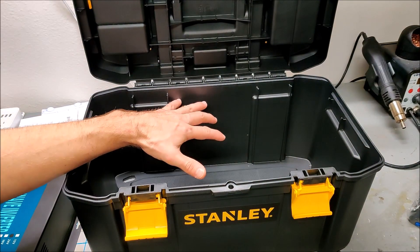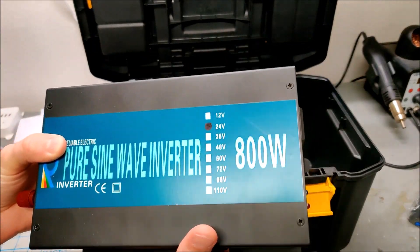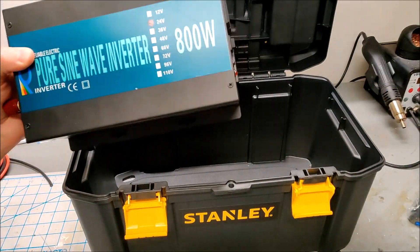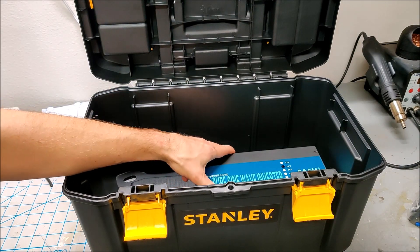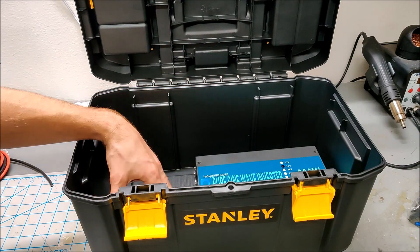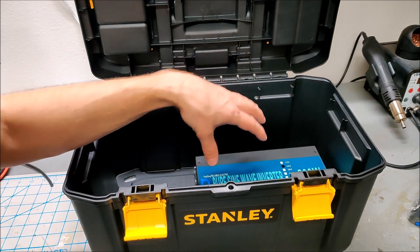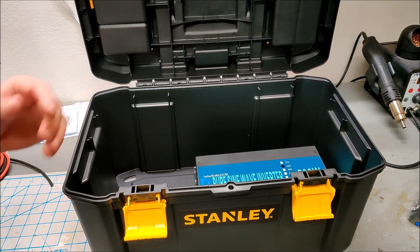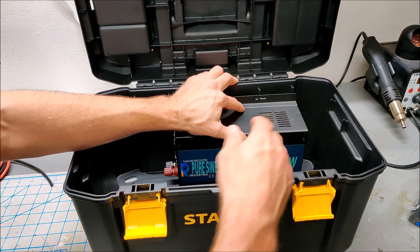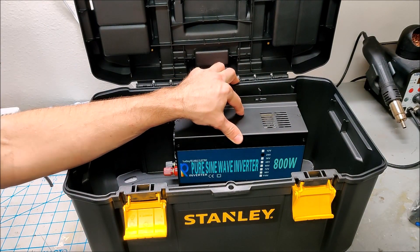It's time to start thinking about the top box and where we're going to put all our electronics. The main electronics is obviously our inverter — this is an 800 watt 24 volt pure sine wave inverter. I can just put it on the floor of the box, but the problem is I don't have much floor space left. I'd almost have to stack stuff on top of the inverter. So I think the better move is to mount the inverter sideways, which still leaves space to mount some of the other circuitry.